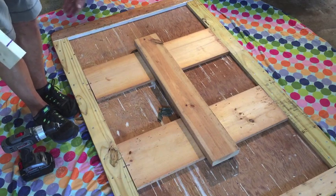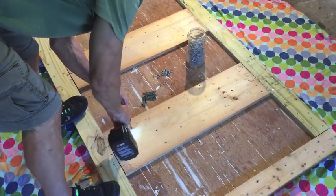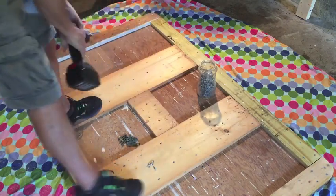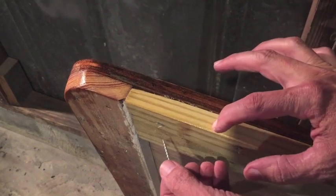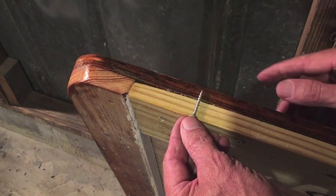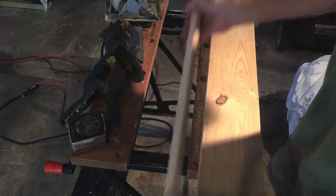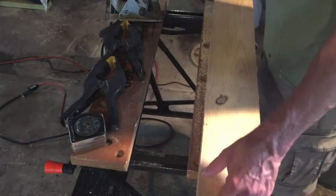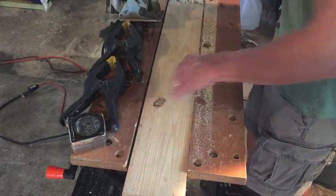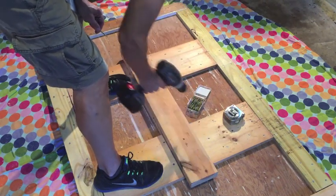I'll get all this screwed in, then put it on the tabletop and put that same 35-pound weight on the side to see if there's any movement. To secure the 1x4s and 1x10s on the underside to the three-quarter inch plywood, I used inch-and-a-quarter exterior screws — just the right length to secure the boards without going through the surface. I had to rip about a half inch off the 2x6 because the jaws only open up to about 5 and 5/8 inches. Two-and-a-half inch screws go through the 2x6, through the 1x10, and into the three-quarter inch plywood.